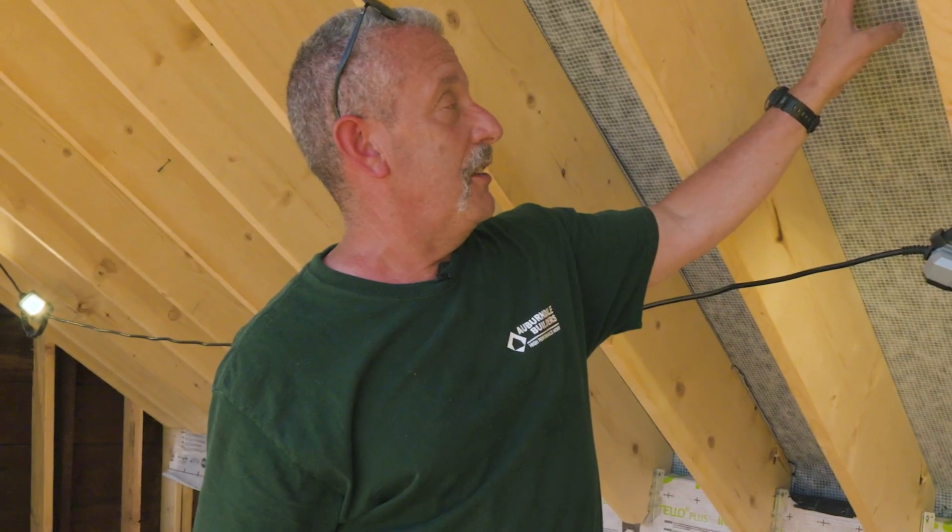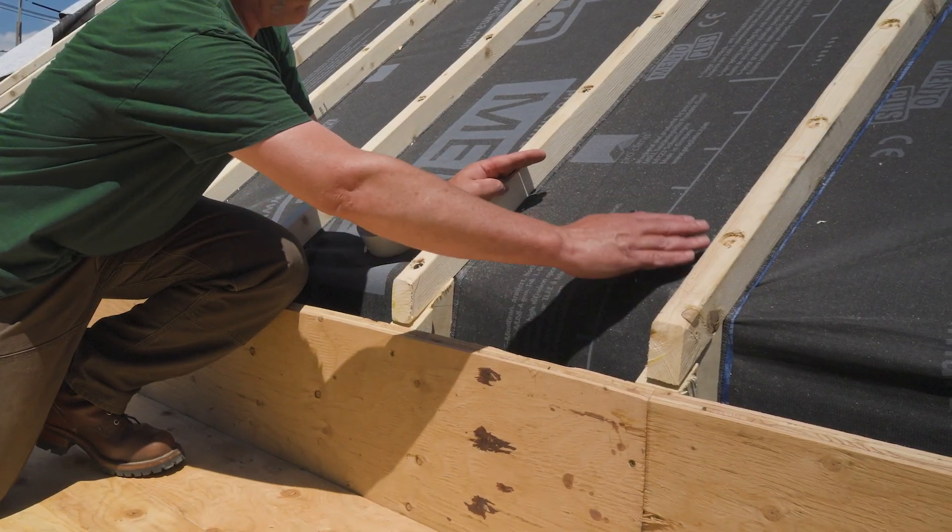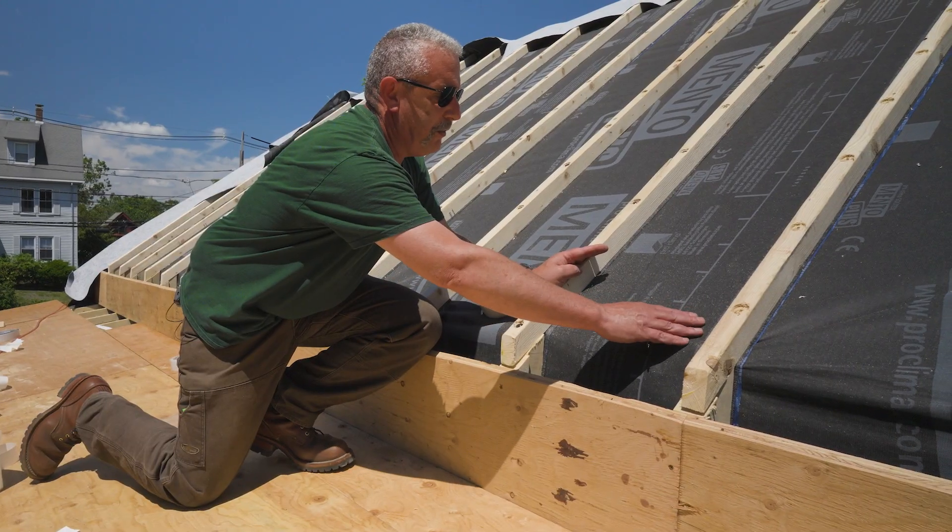Perm rating of 38. That's quite high, because people need to breathe, but buildings need to dry. It's gonna crown up just a little bit when we put our timber fill inside these rafter bays.